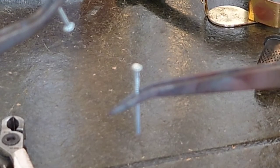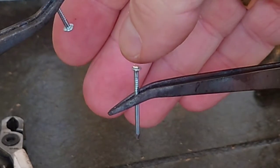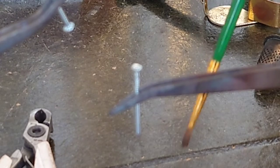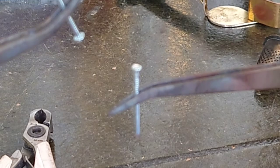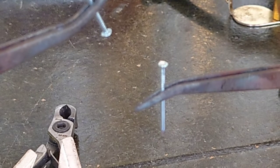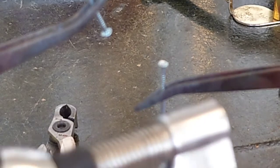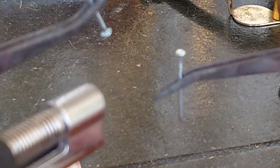So we've taken a piece of silver hard solder. Silver hard solder has a melting point between 745 and 778 degrees Celsius — quite hot. I've cut a tiny piece off using wire cutters and have it sitting on the nail head. I've also applied with a brush some silver flux. You need to use a precious metal flux — the kind of flux used in electrical soldering won't work and will be completely destroyed before you reach the relevant temperatures.